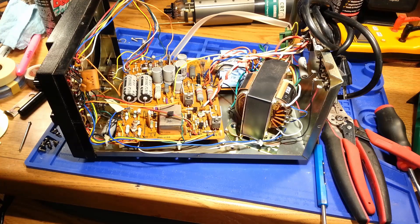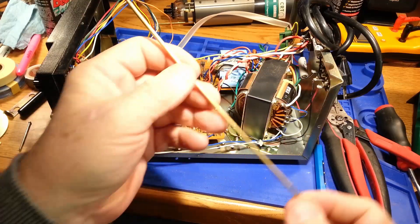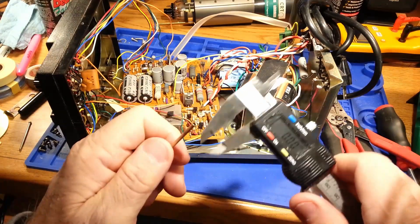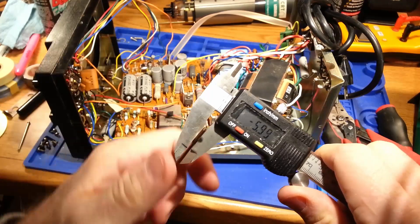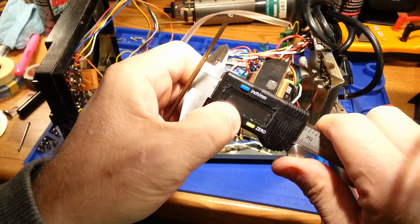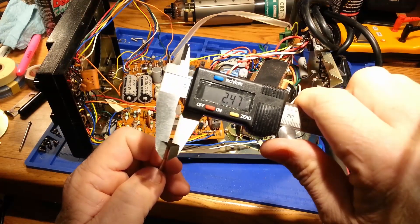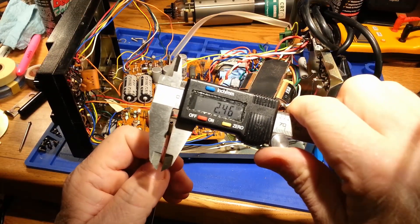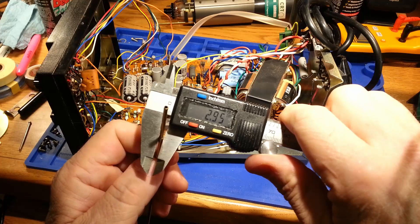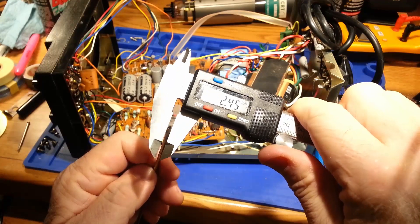What I've discovered is that some regular brass hobby tubing — I have two different diameters here, sliding one within the other. The smaller one is going to be about 2.4 to 2.5mm outside diameter. The larger tube is going to be about 3mm — consider a 2.5mm to 3mm — as far as ordering hobby tubing online.